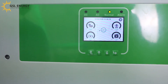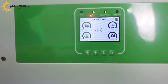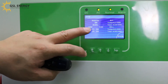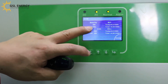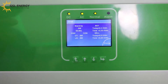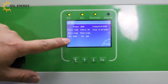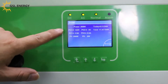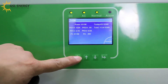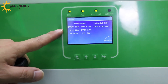Now we start the AC — that means grid power. AC is started. We can see 230V, 50Hz frequency on the display. We then start the PV. The DC indicator light is on. We are using PV1, MPPT1, with only one string — currently at 132V.